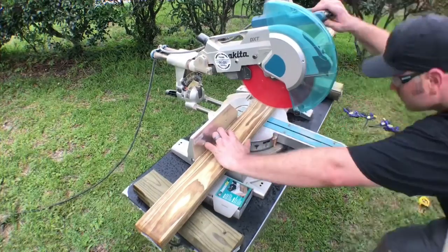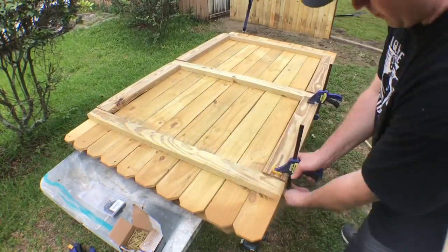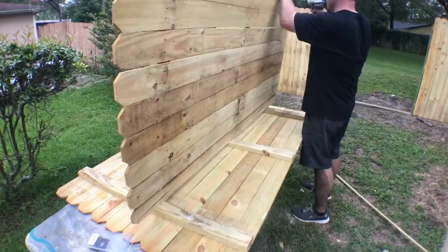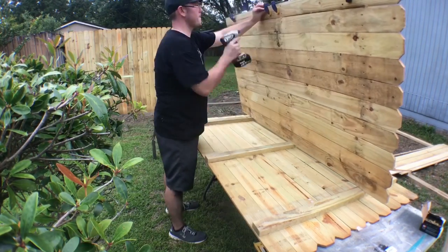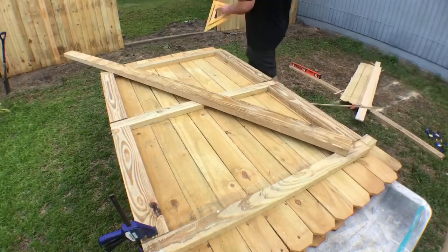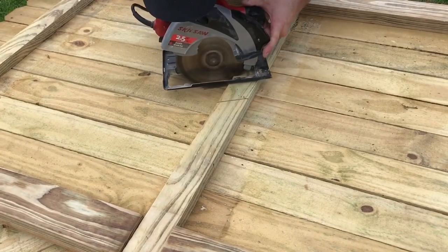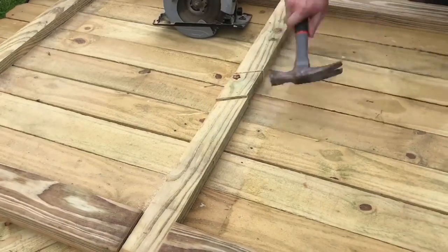As some ducks fly overhead, I take measurements to make the box-framed structure for the gate. These two-by-fours are all cut to length — I clamp them down and install them with inch-and-a-quarter screws. The gate needs a little more lateral strength, so I'm going to take another two-by-four and lay it diagonally across the panel, make a few marks, then take my circular saw set to the depth of the two-by-three and make a few cuts.